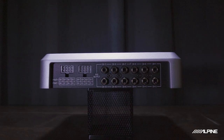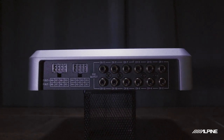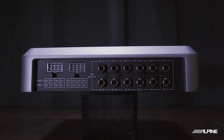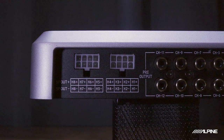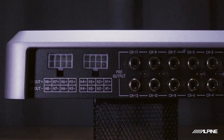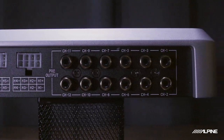Now let's talk about the output side. The 850X is really unique in that it offers two different types of outputs. There are 12 channels of low voltage outs that you would use to directly connect to amplifiers. Of those 12 channels, the first 8 channels actually have a built-in amplifier delivering 25 watts per channel, so you can even power speakers directly off this DSP. This is really cool because it gives you options with your system and even gives you the choice to install a DSP now and add amps later if you're on a budget.